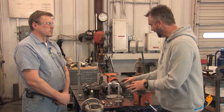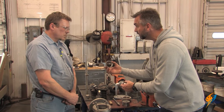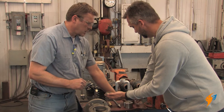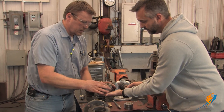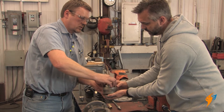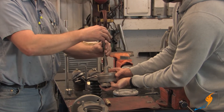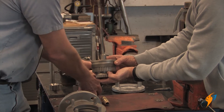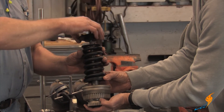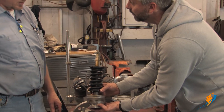Let's show how this is actually put together. You take the lower ring — it would screw down on the nozzle. Then you have the upper ring — it would screw down on the body. Then you would have your disc, which would be in the guiding area of the guide upper ring. Then you have your spindle, your lower washer, your spring, your upper washer, and then your compression screw. And then that obviously would be sitting down inside the valve.